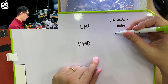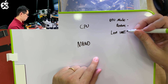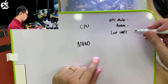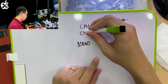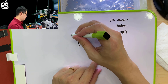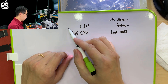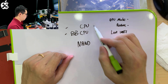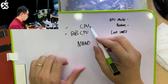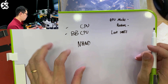After you restore the device, you will lose the IMEI. The IMEI is tied to the baseband CPU. The CPU and the baseband CPU must be a matched set — the same set. If these two don't match, you will also lose the IMEI.